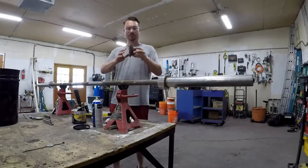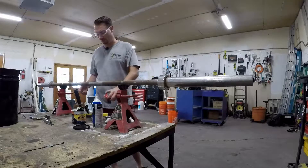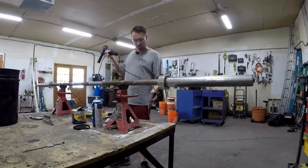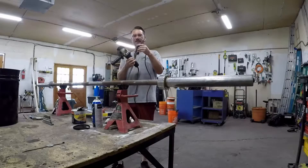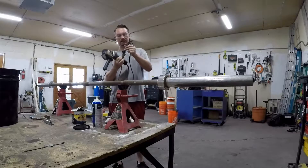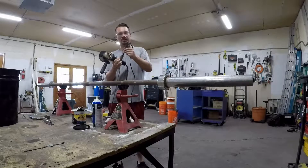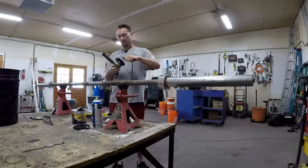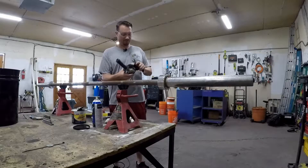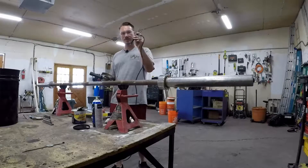Fair warning: these wire cups, as they spin, will chuck little wires off. These stainless wires will get in your skin, your clothes, and everything — it's quite horrible. So let's get rid of our grinding disc. What I like to do is take the tool to remove the grinding disc and tape it to the end of the cord. That way I don't lose the tool, and it reminds me to unplug the thing so I don't get my hand ripped up. It's very easy to hit that switch while you're trying to take your disc off. I just take some Gorilla tape or electrical tape and tape the tool right to the cord.